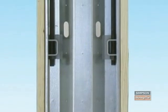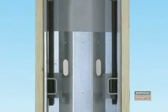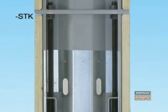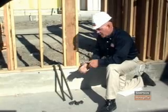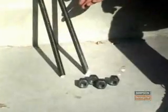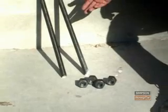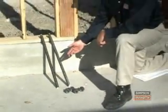The bottom walls for the balloon framing application need to be ordered with a factory-installed stacked wall option. STK after the model number identifies this option. The basic assembly for the balloon framing application is done on the floor. The connection kit comes with two 1x25 inch threaded rods and 4 heavy hex nuts. Let's now review how to install balloon framing on a concrete foundation.